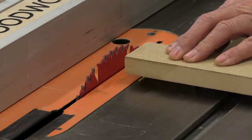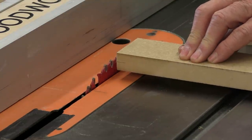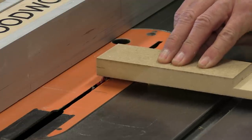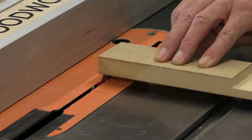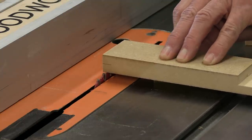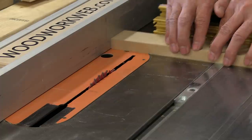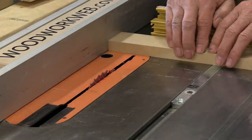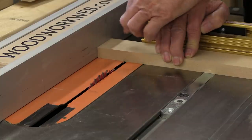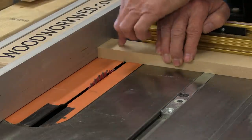Now to set the height of the blade: my three-eighths measuring bar — remember that's half of three-quarters — I'm going to set my MDF on top of that and lower the blade. I drag it back a little bit so the blade doesn't catch, then I raise it ever so slowly until the blade just barely catches — I can feel it just barely touching. Now, like a lot of things in woodworking there are exceptions to the rule: I've always said never use a miter gauge with the fence, but as it turns out you can — only if you're doing a partial cut. If I was cutting this all the way through that would be very dangerous and would kick back badly. But for a partial cut we can do that, so I'm going to do that on both of these parts.